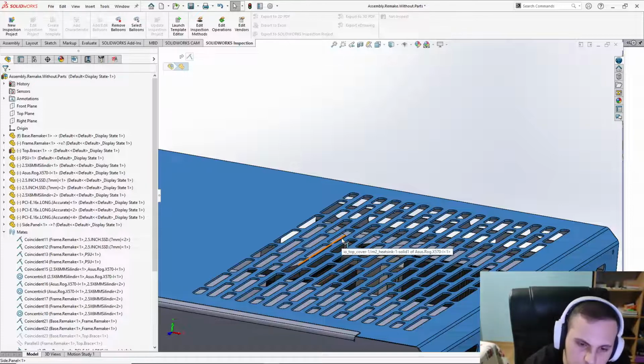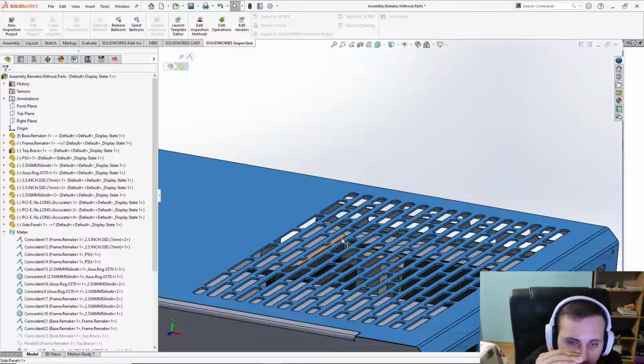But just to make sure that we're not putting the CPU cooler fan right up against the side panel, I suggest that you leave about 2, 3, if possible 5 millimeters of clearance. So what we recommend is 58 millimeters. But if you really had to push for it, you could go up to 60 millimeters of clearance.